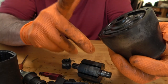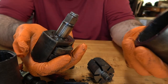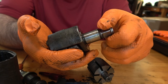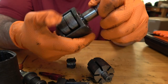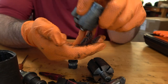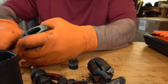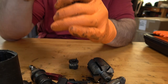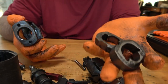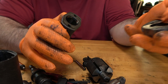The hammer housing houses the hammer assembly, which is the two hammers, the hammer cage, a couple of pins, and the anvil — that just drops easily out of the housing. This comes apart very simply: just pull the anvil out of the assembly, you have to twist and turn it. Those two pins, if you just hold this thing upright, should easily drop out — sometimes I need a little help if there's lubricant on there. We'll just push them out from the top using a pocket screwdriver. Then turn the cage onto its side, pull it up, and there are the two hammers.